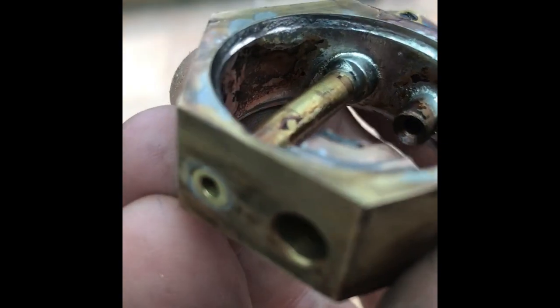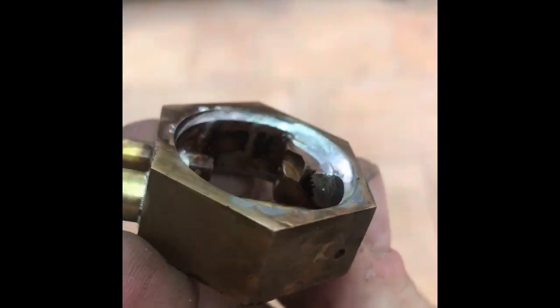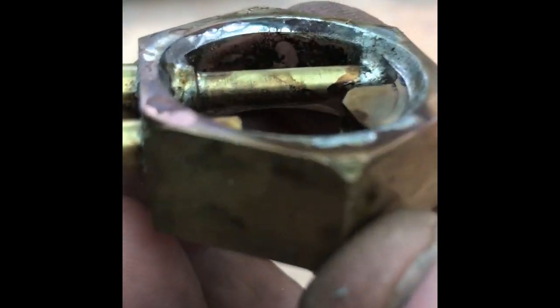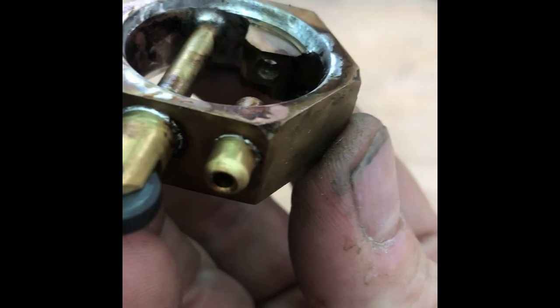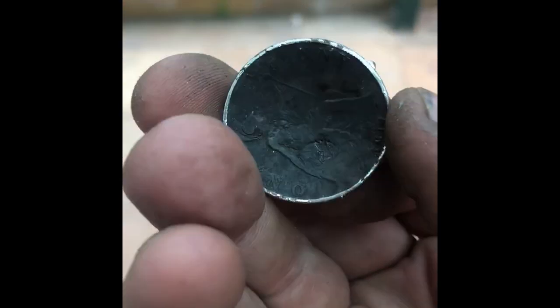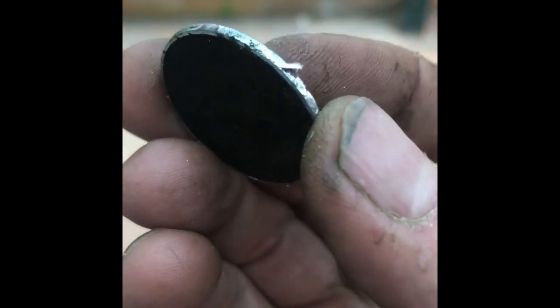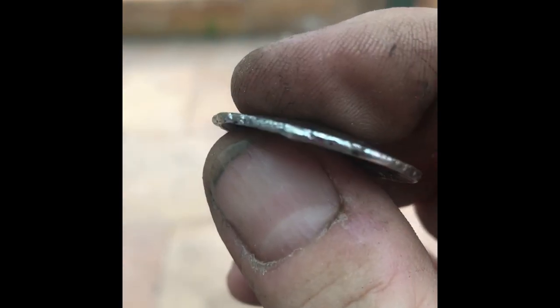The inside rebate for the pennies is now just about full of solder — I've fluxed it and cleaned it. Cleanliness when you're soldering is extremely important; grease from your fingers is a no-no. I think I've got enough solder in there. There are a few defects but enough for it not to leak. The best way is also tinning — tinning the copper with solder. I've done that around the outside; you get big globs of solder and that silver ring will sit on the seating.